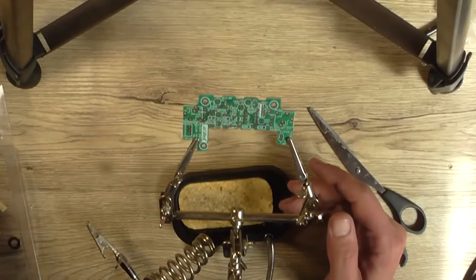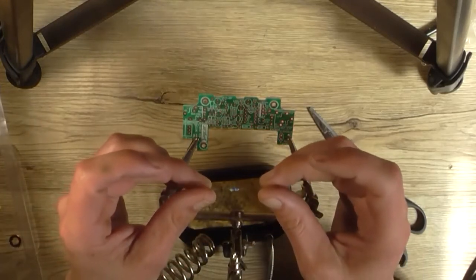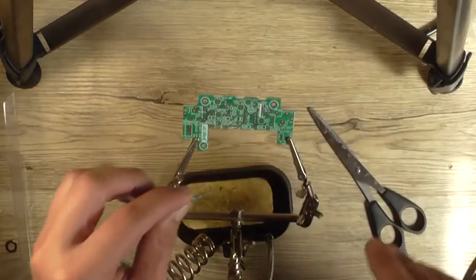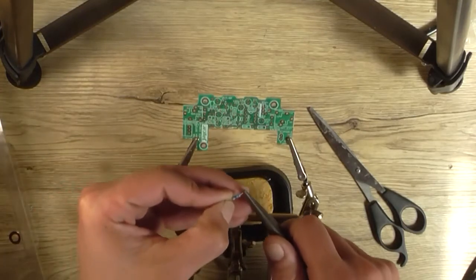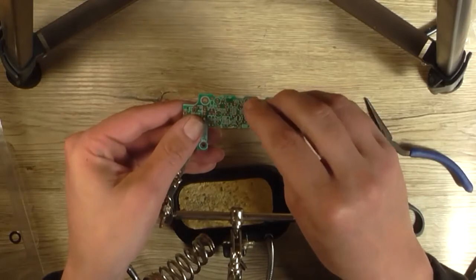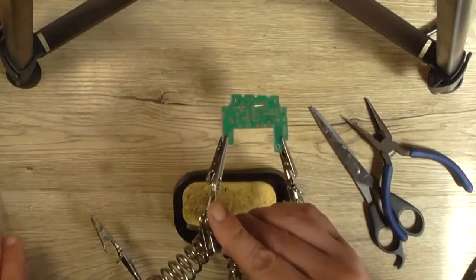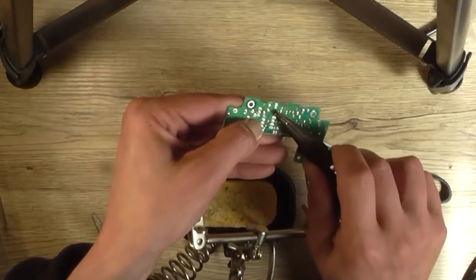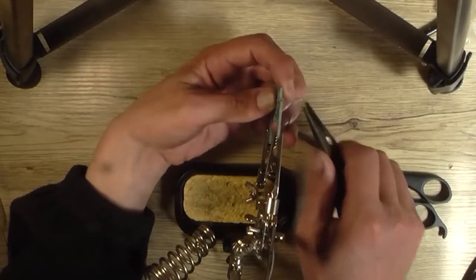Now, I'm going to start with the resistors, and we have got what looks like 470k. There's one there. Help if I had a pair of pliers. So I'll install this first resistor. Actually, this is double-sided too by the looks of things, with plated through holes. Indeed it is. Trying to get that flush. There we go. Now it's flush.